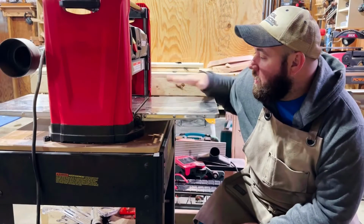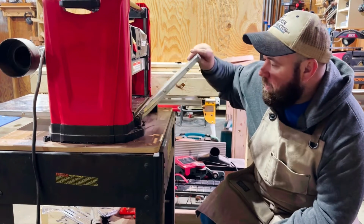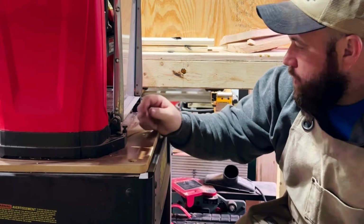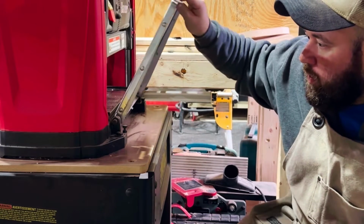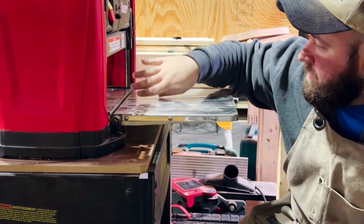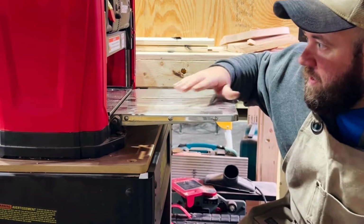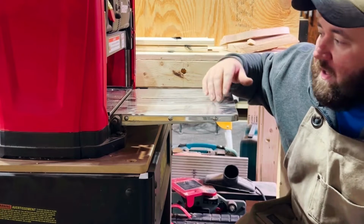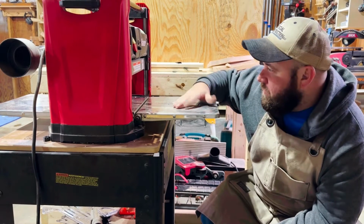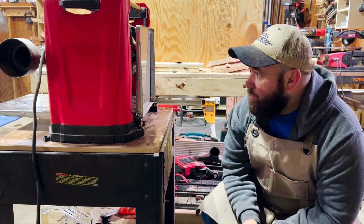All right, so to adjust your beds, to try and avoid getting sniped and all that, you have these 2 screws right here. You'll just twist them and then pull it down. And then I got like a little torpedo level that I'll stick right here and make sure it's level. And I'll do both sides, and then I'll take like a 4-foot level afterwards. I'll put it on here and I'll just make sure it's level and it's flat. And then that's how you do that.